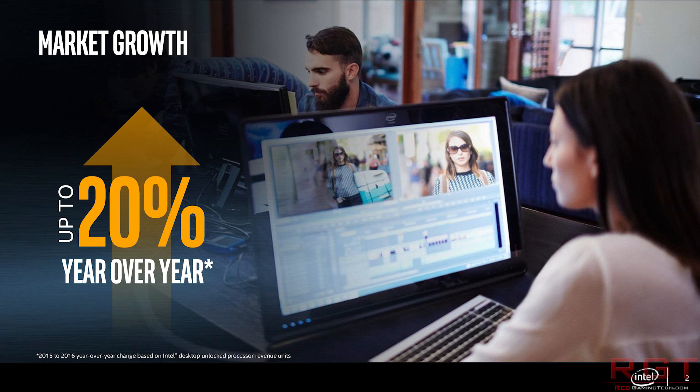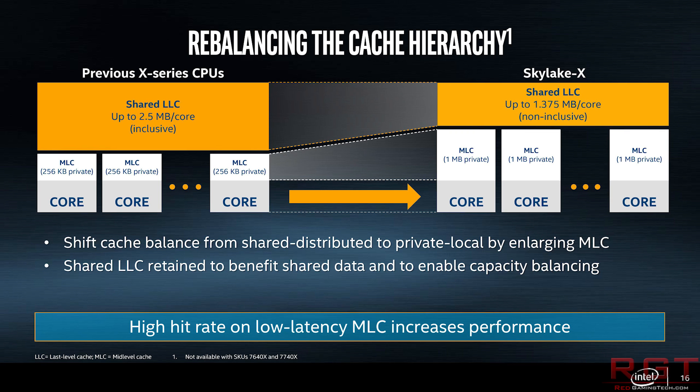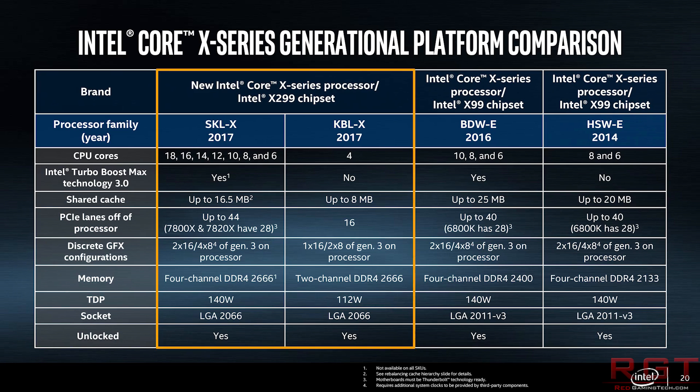It is imperative to know that AMD have already embraced this. We've already seen it with Vega, and we're most likely going to see even further adoption with Navi. AMD are also using it for EPYC and Threadripper as well, and Nvidia is also jumping in on the act with Volta. But there are multiple different ways of creating a heterogeneous type of processor: multi-chip packages, silicon interposer, and EMIB — once again, Embedded Multi-Die Interconnect Bridge.